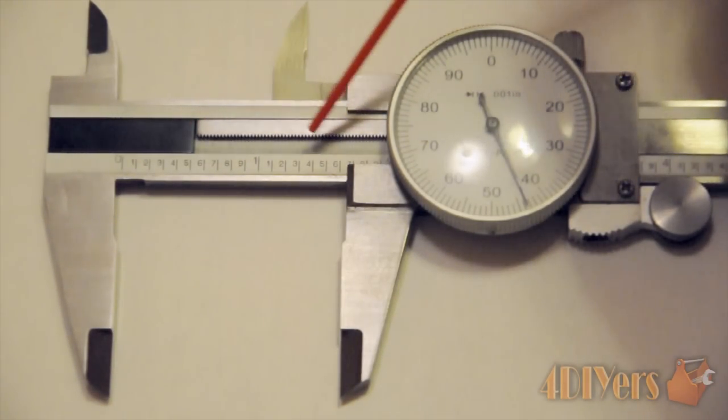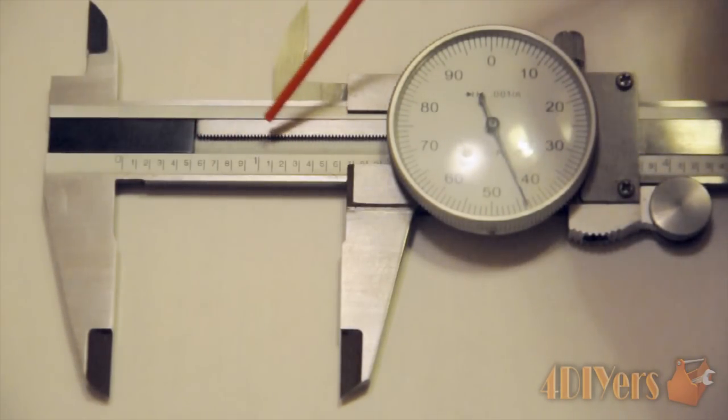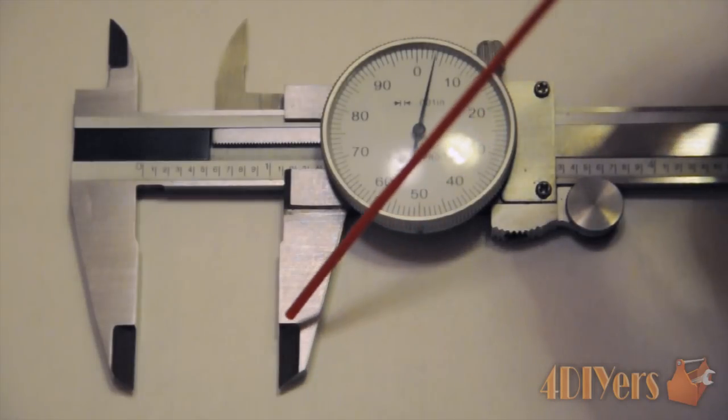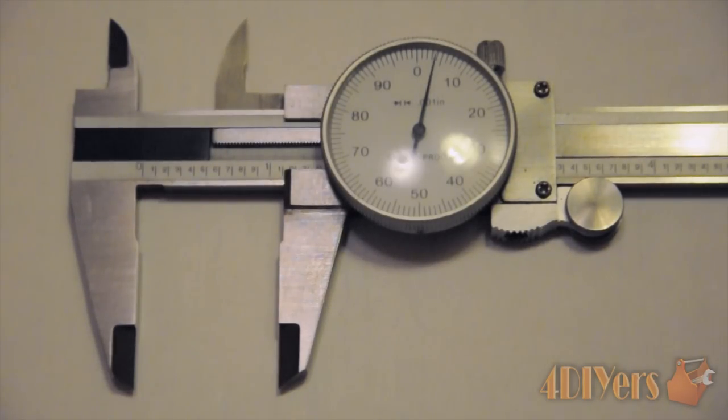You don't want to add too much or let debris from metal shavings stick inside. If you find it is sticking, use a little cleaner to spray it out and then apply some lubricant again. Before using your vernier, always make sure all jaws are clean — whether the outside diameter, inside diameter, or depth gauge. If you are working with dirty parts, grime can build up and affect the accuracy of your tool. To clean them, use a piece of paper, a cloth, or a little degreaser if the grime is baked on.